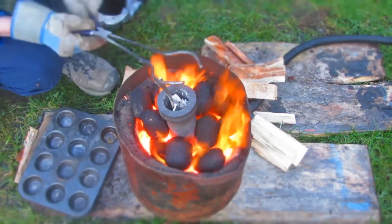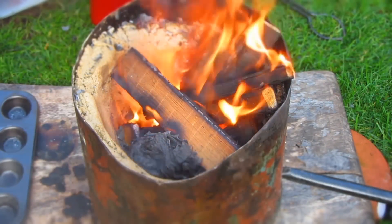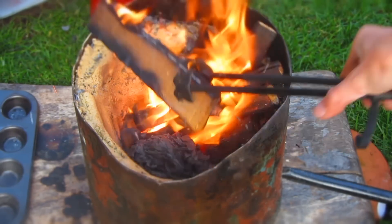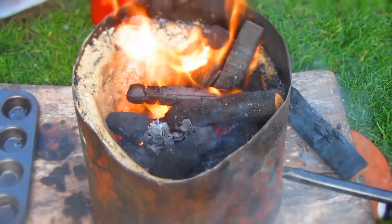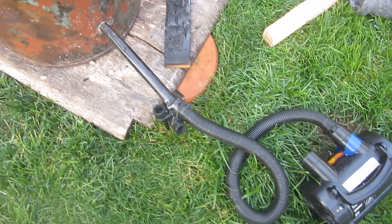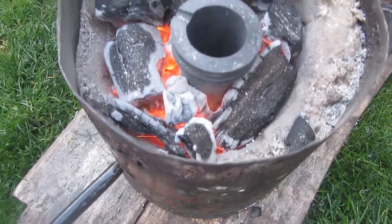In a previous tutorial I showed you how to melt scrap aluminium down into pure aluminium ingots. Now in this video I'm going to show you how to melt those ingots into these slingshots. First things first, you're going to need your heat source — your forge. I like to use a coal-powered forge since it's very simple and quick to use, but people have also used propane forges, induction forges, and even arc furnaces. There'll be a link in the description to Grant Thompson the King of Random's tutorial on how to make a simple coal or charcoal powered forge out of a metal flower pot. It's powered by an air blower that forces oxygen into the fire, making it hot enough to melt aluminium. Once lit and the air supply is on, it only takes a couple of minutes to get really hot, then you can put in your crucible and start melting.